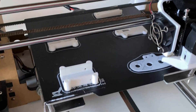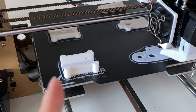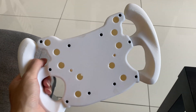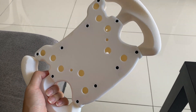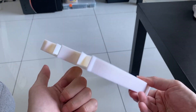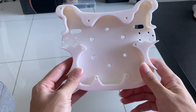Since I only have access to a 3D printer, that means no cutting of aluminium or carbon fibre, meaning my options were quite limited, with this one from Thingiverse seeming to be the best one available for free. The parts all took a total of around 20 hours to complete printing using PLA-F. This includes the magnetic paddle shifters from AM Studio. Given the load that this steering wheel was going to face from the direct drive wheelbase, I upped the counts for the perimeter, top-bottom layers and infill.